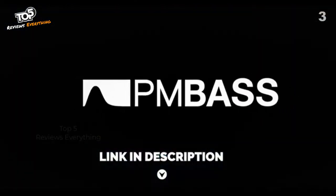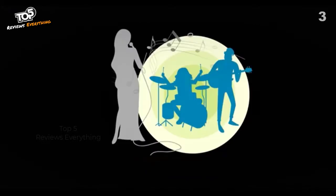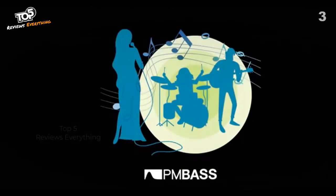So PM bass or phase matching bass, what does it actually do? The best way to think of it is like an intelligent loudness control, and we all know that loudness controls tend to be used at low volumes to help fill out the sound. Now the major drawback with using a loudness control is that you get a phase shift in the low frequencies, and these problems can occur even up to 300 hertz, and this in turn is detrimental to one of the most important areas, which is the vocals, and essentially everything becomes blurry and muddy with a lack of detail. But PM bass has been designed to eliminate all of this muddiness, which allows everything to snap sharply back into focus.